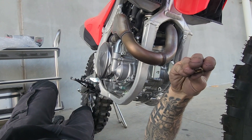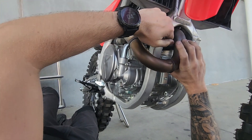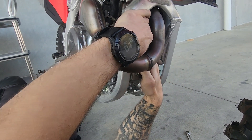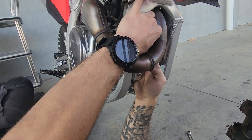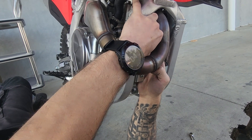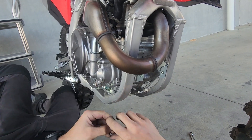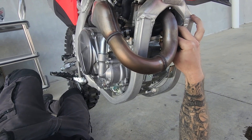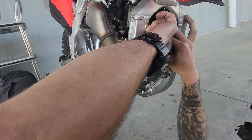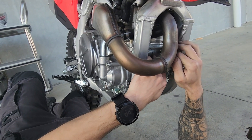So they're sitting there lightly and we're just going to spin on these flange nuts. They're a steel zinc plated flange nut — they're serrated, so they bite into the material and stop them from spinning off. Nylocks are not a necessity in this situation. These are good — you can take them on and off and reuse them. Once you've used a nylock, you're pretty much meant to replace it because it doesn't have the same effect. Plus they're a pain to spin on a bolt like so.